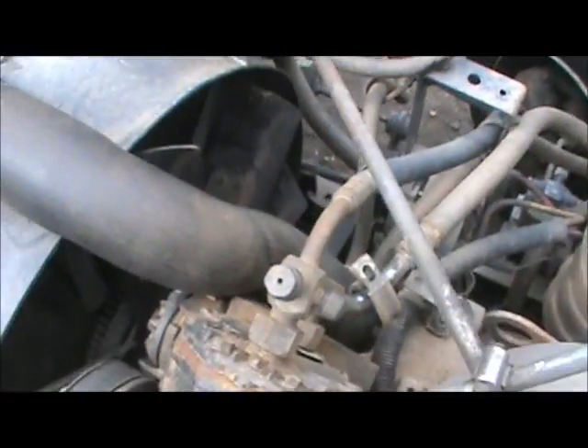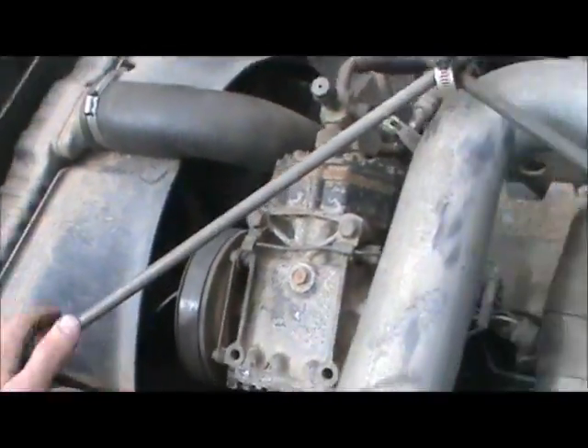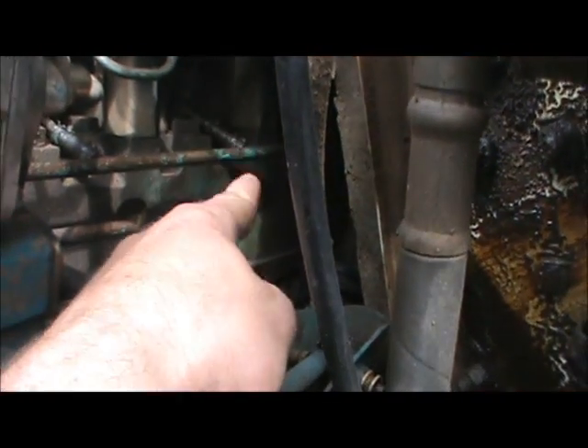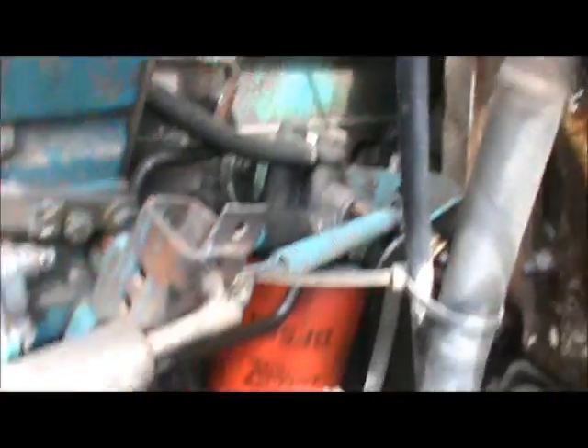Sweet little motor. We're going to have to replace a bunch of stuff. The recycling company dropped it off. Radiator hose is shot, I'm going to change all the fluids. It's got a diesel leak coming from that back return line, so I'm going to have to get that fixed because it's just leaking diesel everywhere. Current gas prices don't dictate that as a good thing.